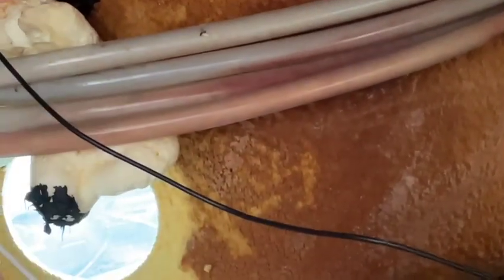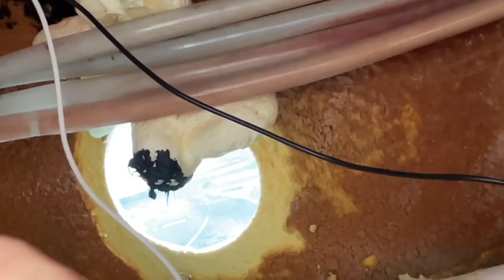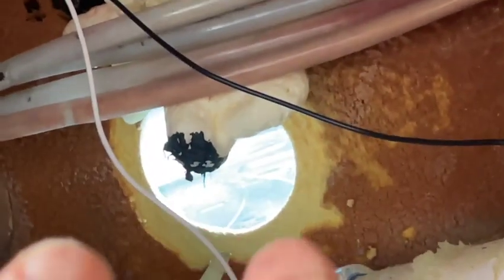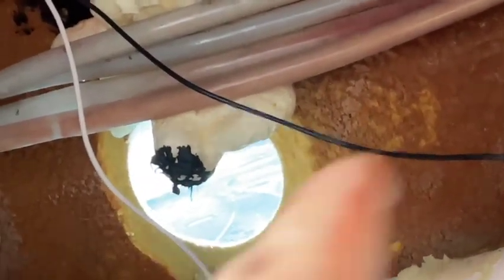The silicone will tend to come through the hole. Once the fitting's in I'll put a bead around the inside edge to fill any gap, and then the lock nut comes in and seals on that as well — giving it all a big seal. Pull it up nice and tight and the silicone will take up all the gaps. They don't actually supply rubber washers with these, and when you're using silicone rubber washers tend to pop out so they can be more nuisance than good. You can get soft plastic washers that don't pop out if you've got a bit of a curve to take out, but normally silicone is enough. Get it onto a flat surface if you can, but silicone will take up a little bit of curve and shape.